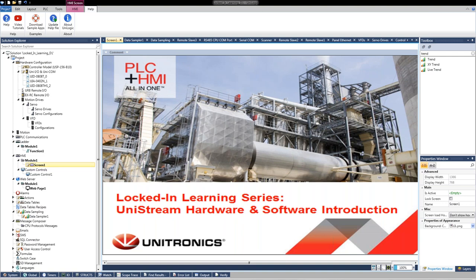PID automatic tuning. Pretty advanced question, but just to answer it, we do support PID. And the way that we would do automatic tuning is what's called an auto-tune, basically where you let the process run in auto-tune, and it's going to run at 100% power and at 0% power until it exceeds and then falls below the set point a number of times and learns how the system reacts. And then it is going to give you good starting values for your P, I, and D parameters. At that point, it should control the system as you need, but even if it doesn't do it perfectly, you have a much better starting place to fine tune those parameters from.